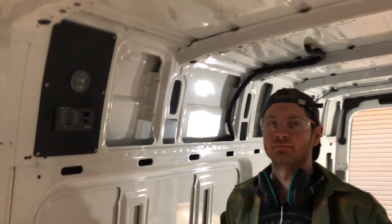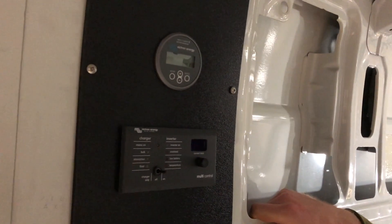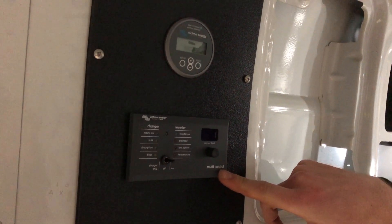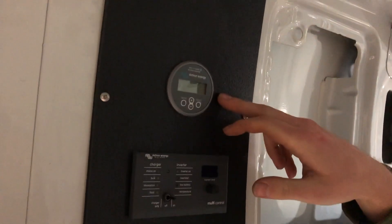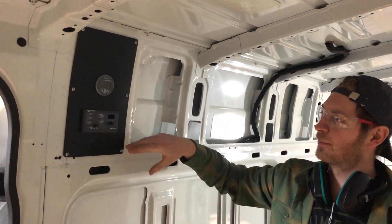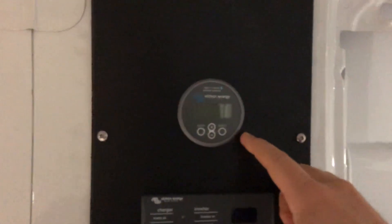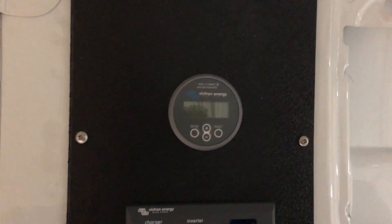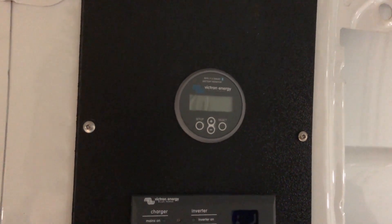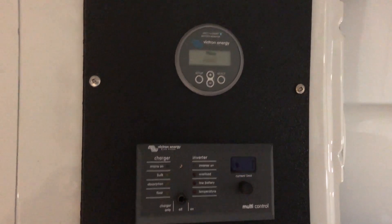Yesterday we talked with Sean about some comm cables being routed, and it looks like he's installed the monitors here. So Sean, tell me what these things are. Basically, these are two monitors for our system. We have a remote monitor for our inverter — this gives you the ability to turn it on and off and to do current limits. And then this is our battery monitor, which is also Bluetooth compatible. We built a piece of ABS plastic and cut it to the shape we wanted, then oscillated these holes in to mount the monitors. For the BMV 712, you don't really need the physical monitor visible because you can use a Bluetooth connection — that's more a matter of customer preference.